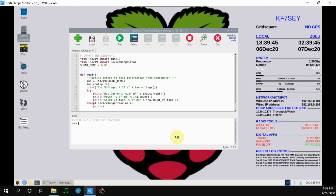On the Pi you can run this Python script, which I got from the website — I'll put the link in the description below. When you run it, it reads the current, the amperage, and the voltage. The voltage is coming from the regulator. You can see I'm drawing 817 milliamps at the moment and the output from the regulator is 5.152 volts.